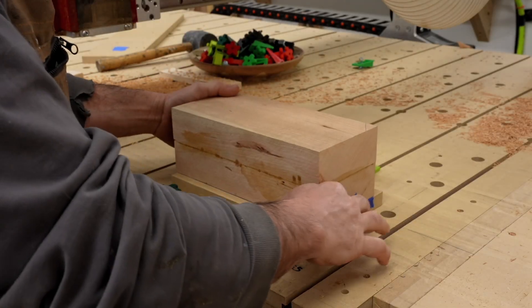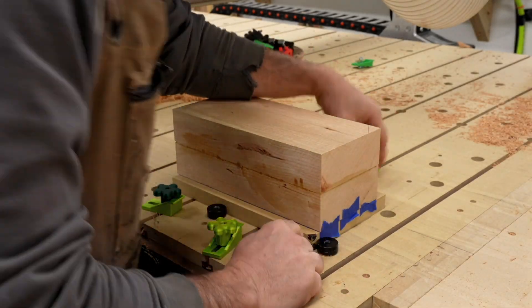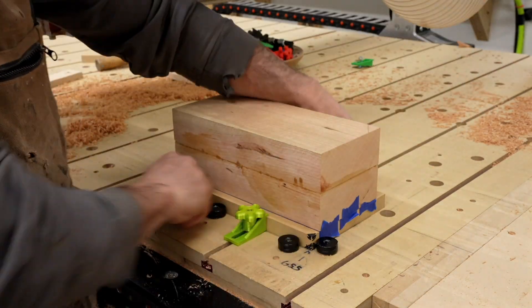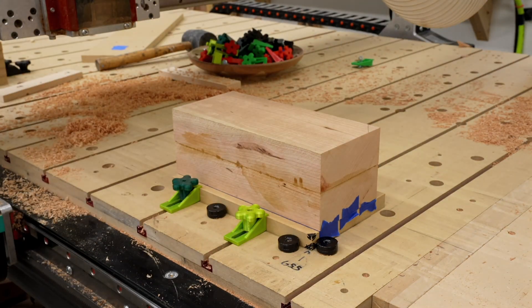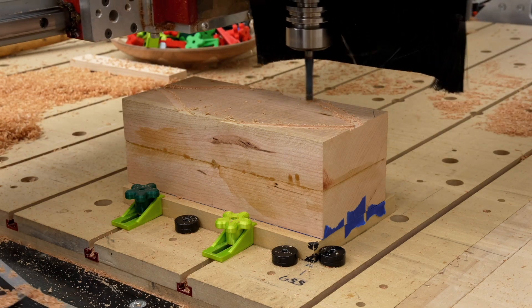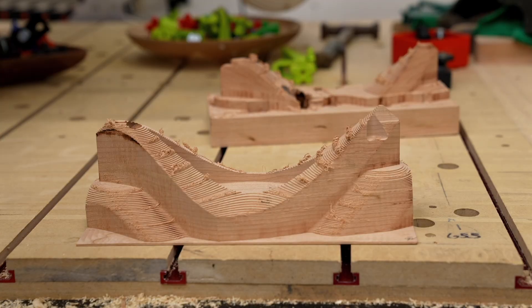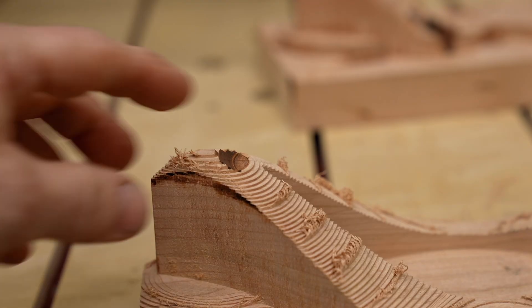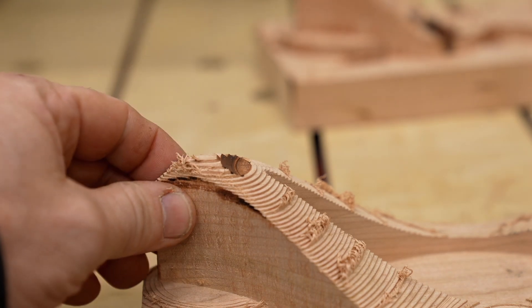The workpiece is just slightly offset from the bottom of that mini spoil board, giving me an area where I can use my 3D-printed toe clamps to clamp it down onto the CNC table bed. I can clamp it at the same spot again and again to do multiple operations. I always do simulations in Fusion to check for collisions, but for some reason my bit lengths weren't set correctly and I got a slight collision with my collet that burned the piece a little bit. So I had to rethink a lot of my toolpaths.